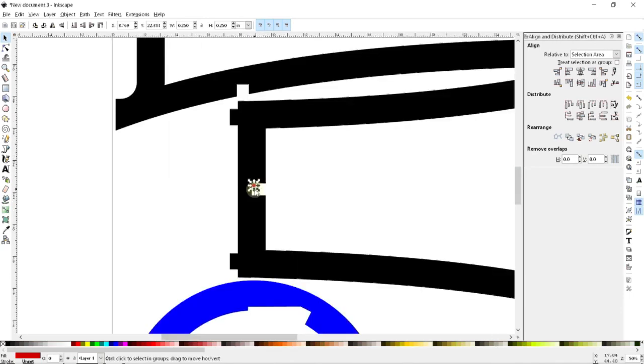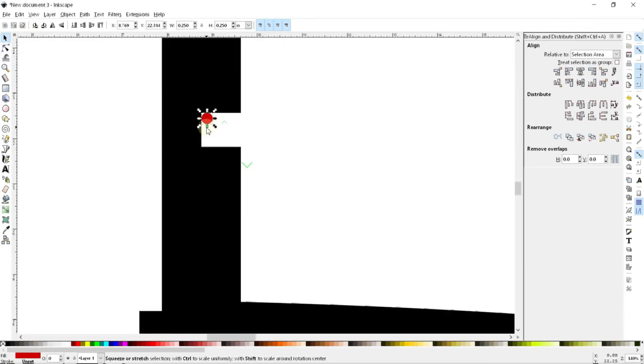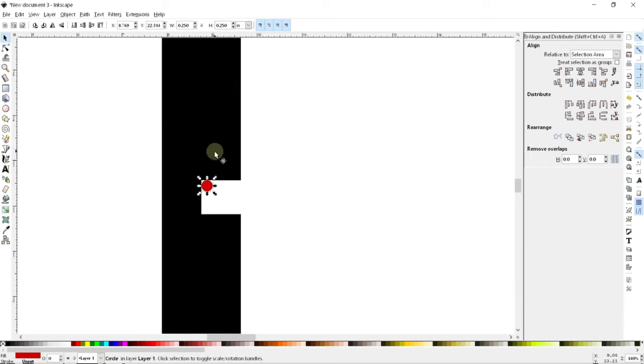In some cases here, for instance, this part here inside the leg, I actually want that radius. It's kind of nice, it makes it look a little nicer, and it makes it stronger. But here in these tabs and slots, it's going to kill me, because it means that my parts aren't going to fit together the way I was hoping that they would. And so what I'm going to have to do is tell the machine to eat out extra material here in order to ensure that my pieces will interlock the way I'm hoping that they will.